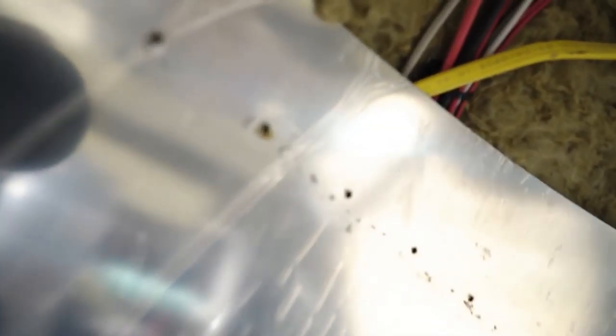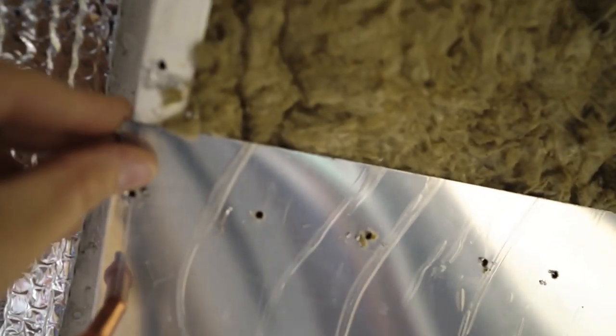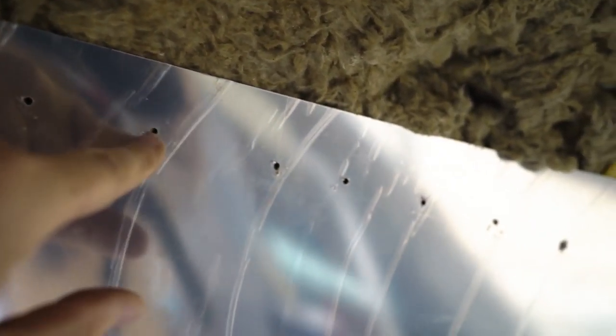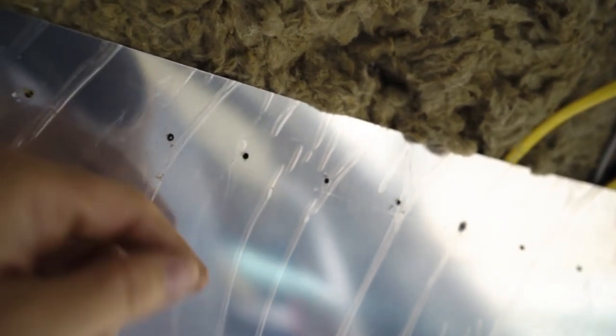So let's get on with the process. So now with the panel removed, you can see where the holes landed, and there's a bunch of metal shavings and such on there. Excuse me. So I'm gonna get all those metal shavings out. I'm gonna start here and peel this plastic down just below, if not right on the hole. The clecos will push right through it, and that will make it much easier for me to pull it out from underneath the layer,